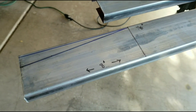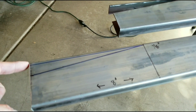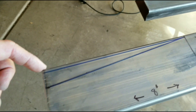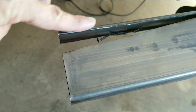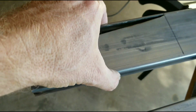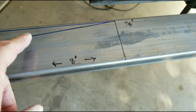On this one we're doing eight inches — from eight inches at the front back. I've done twelve before but I think eight will look more dramatic. I'm going down one inch. There are two lines on here: one is one-eighth inch down from the top. We're gonna make two cuts. You can see on the cut I've already done — we cut it one-eighth inch from the top to keep that nice round angle, and then one inch down. So this is gonna be clamped down and welded, coming down a little bit tighter. A little bit of hammering and we'll weld it, then square the end off with a grinder.